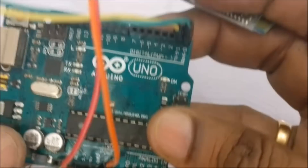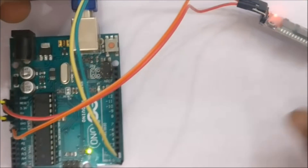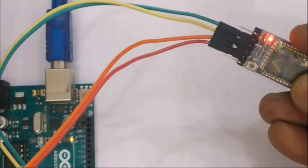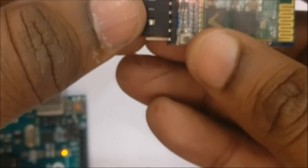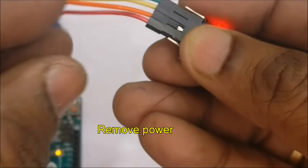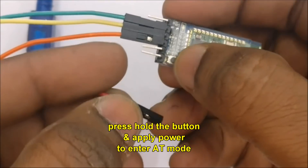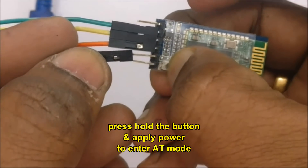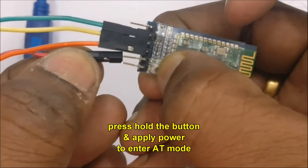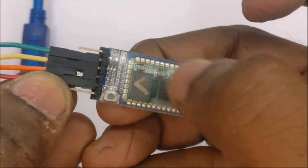In this configuration mode the connections are straight — not reversed: RX to RX, TX to TX, and ground to ground. Plug in the USB cable to the Arduino. The HC05 module LED will blink fast indicating discovery mode. Pull out the power, keep pressing the button, then provide the power — the module will enter AT mode, indicated by slow blinking of the LED.